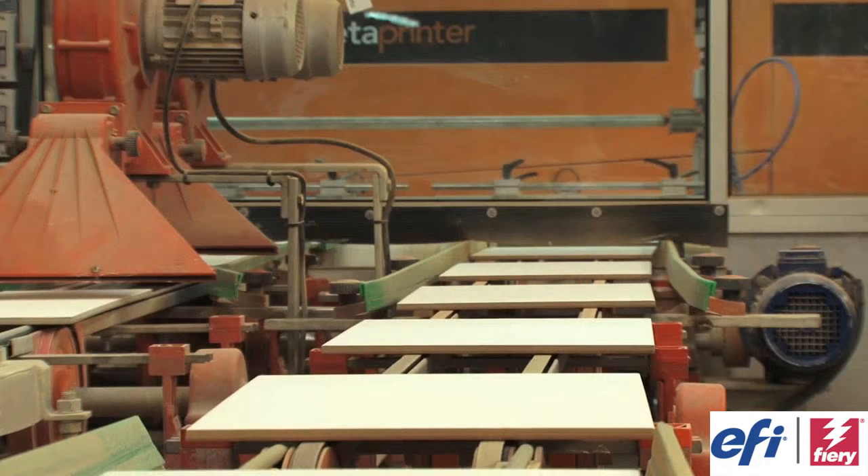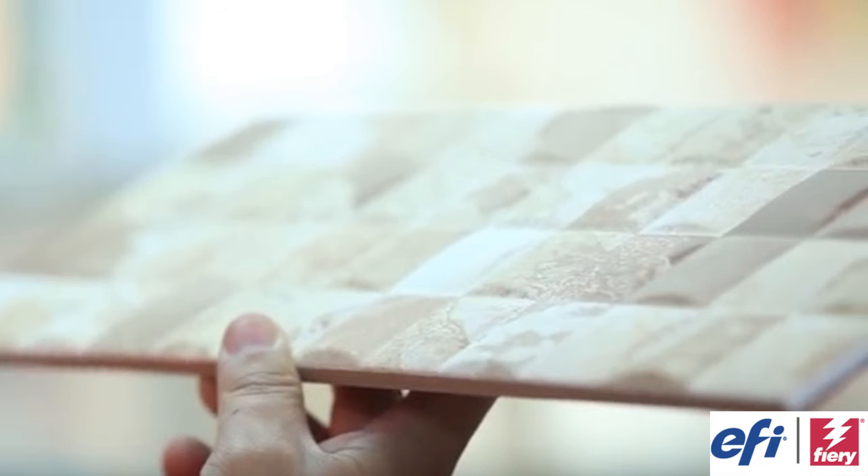This is just an image of the Cretaprint machine. It's within the tile production facility — it's dirty, it's humid, it's loud — and sealed within is the printing machine. It's printing on the raw tile, and later on, the tile is glazed. It's not a print on a glazed tile; it's a print below the glaze. So it's truly industrial: 50 meters per minute, up to 1.80 meter width. It might not only be flat — it could also be shaped, three-dimensional.